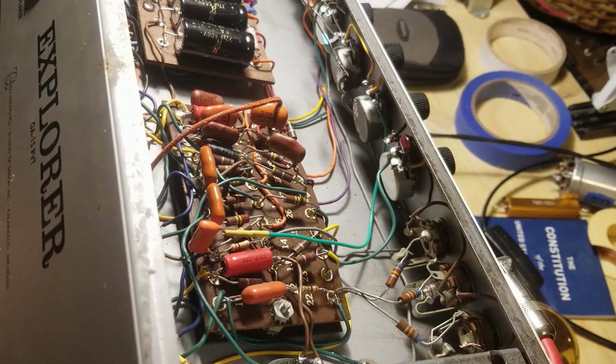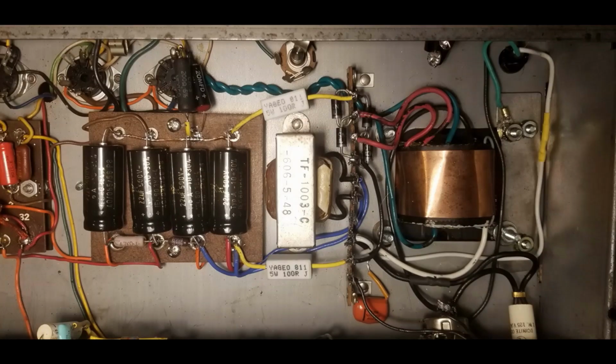I was getting a lot of buzzy overdrive. I thought it was grid distortion, and I figured out a couple ways to test that, and it wasn't that. So I just went back to the drawing board, so to speak, and looked at Fender's tone stack. One of the things I failed to mention was why I thought the sound was so bad with my flat EQ curve that I had to change it to something else.